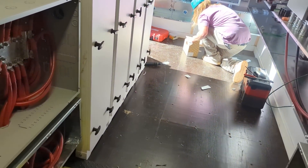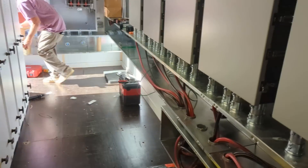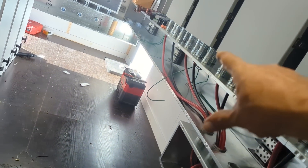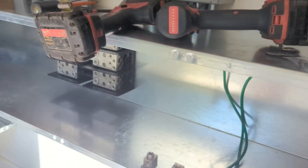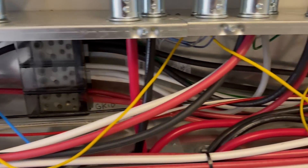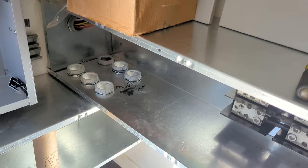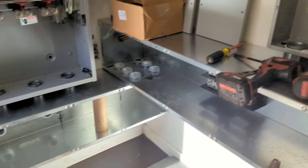We're running the cables across the floor and hiding them back here, getting them into the trays — we'll clean that up. Pretty soon we'll start running the AC wire from the loads. We've got a grid PDB there, another grid PDB there, and then our load which is a double — they'll combine out here to a double and then hit the top side of that bypass. We've got chase nipples and access to this bottom gutter back-to-back with the outdoor gutter; solar is tucked away nice and neatly out of the way.